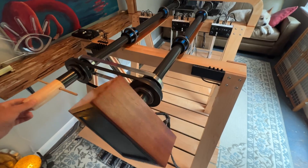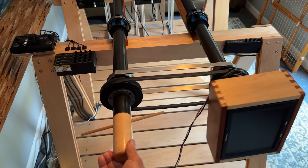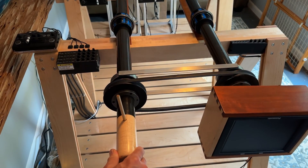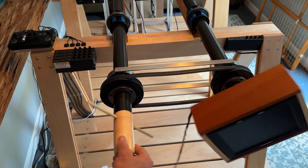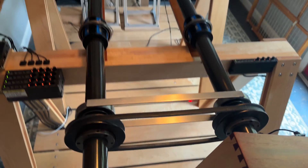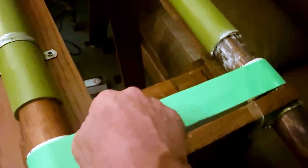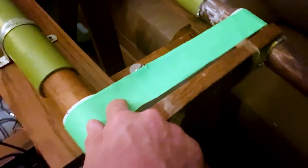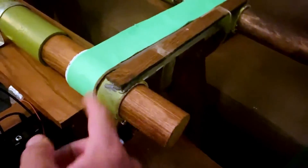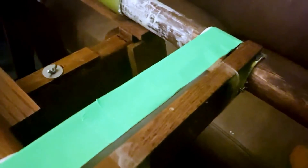In fact, too easy. Just the weight of this cable to the monitor rotated the shafts. It's nice that they spun so freely, but I would like to be able to let go of the handle and not have anything move. And that brings me to what transfers the linear motion of these shafts. In the original iterations, I used a rubber Van de Graaff generator belt to transfer the rotation, and small pieces of PVC tubing with either screws or tape on either side to catch the motion and transfer the linear motion of one rod to the other.